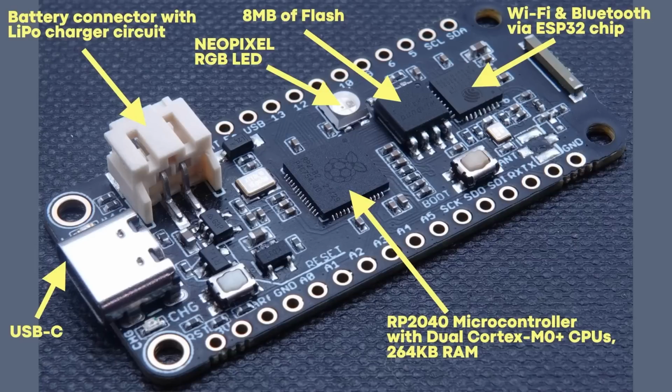It's great having one of those, but often I wish I could have two or three more to actually tell me what's going on. Here we've got an RGB one, so you can change the color. One of the demos I'm going to show you is I change the color of the pixel as it goes through different states, like powering up and connecting to the Wi-Fi, and then getting synchronization for the time, which is one of the projects I'm going to show you. It changes the LED as it goes along, so it's a really good way of communicating the status of the board. And then finally, there's 2 buttons on here.